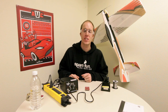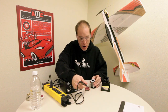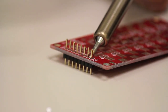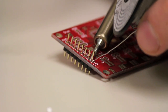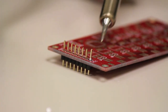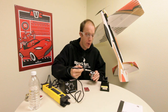Now we're going to show you how to do a simple through-hole soldering joint. I don't want to use the very tip of the iron tip to make contact — I want to use the side, making sure that the iron makes contact both with the circle and the pin. So we're going to put it on the side here so it's making contact with both pieces. I'm going to count to one, and then apply my solder. Apply the solder for one, and then pull away. This should give us a volcano-shaped piece of solder. After I've soldered the joint, I need to apply more solder to my iron tip to protect it from oxidization before putting it back in the cradle.